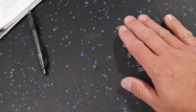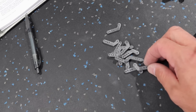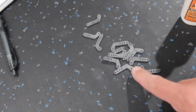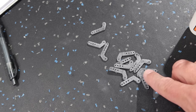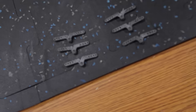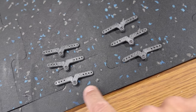We're moving on to the hinges for the flaps — this is going to be a tricky one because the manual is fairly limited. We've pulled all the hinges off the little board they come on, sanded them all down. Now we need to tap those for a 2-56 size hinge point and get them screwed together.